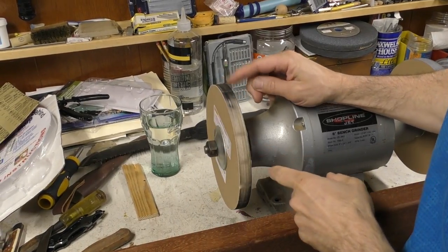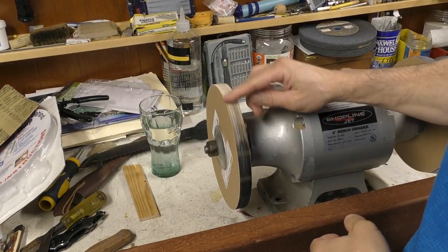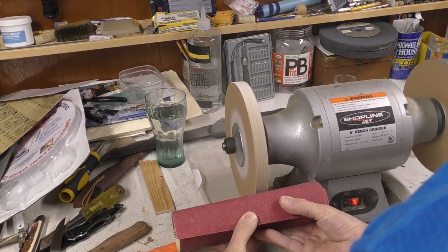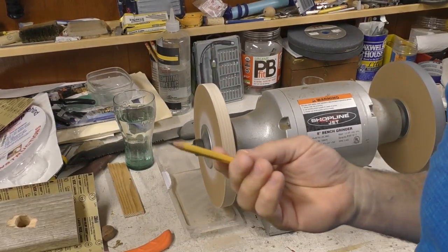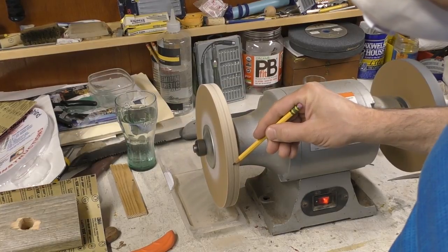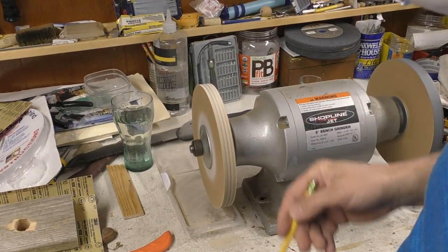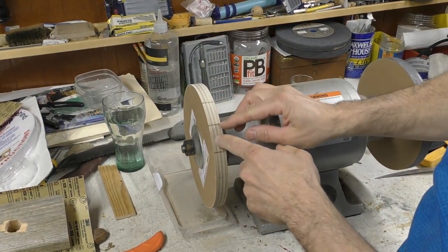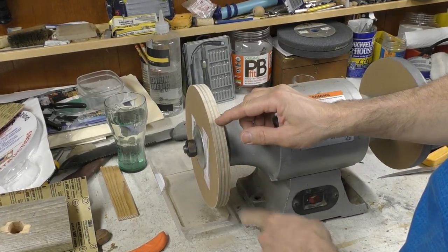You can see how two spots of the wheel are black, and that's where it's rubbing the most - meaning it's not rubbing evenly. So I'm going to just touch the sandpaper to this and see if I can grind it down a little bit just to make it perfectly even. I'm going to do a test with the pencil here. The pencil covered the whole wheel - three pencil lines covered the entire wheel. I think that worked well.